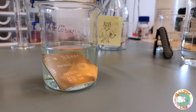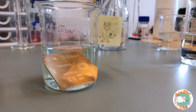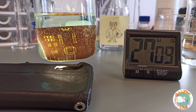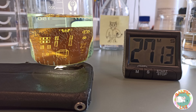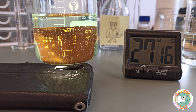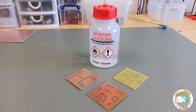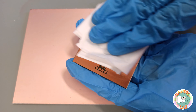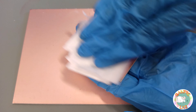The required etching time depends a lot on the different features present on the PCB. However, we found that a great method — especially with smaller SMD footprints — is to backlight the PCB briefly to be able to tell whether or not the etching process has been completed. After removing the PCB from the etching solution and rinsing it with water, the last step is to strip off the remaining photo resist using some acetone.